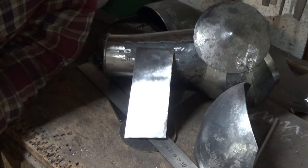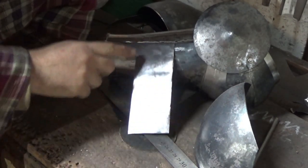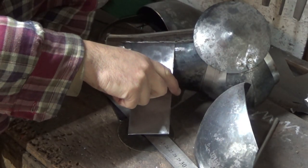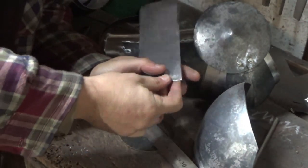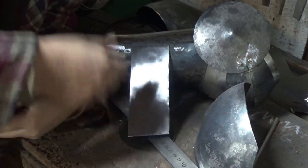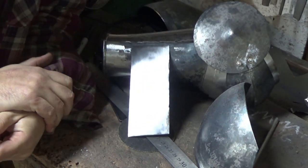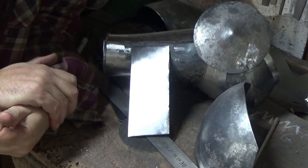I know all of the technical terms! What I'm going to do is make a hinge to go in this vambrace, about that size there. All I've done is cut a strip that's long enough for me to hold - I'd have preferred it a bit longer but that was the offcut I had. We'll start the process by bending that over and putting a nail or piece of metal through it so we can start the basic shape of the hinge.